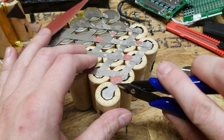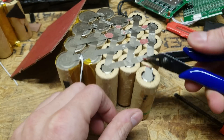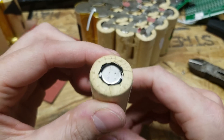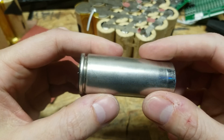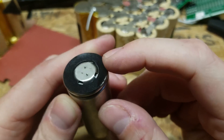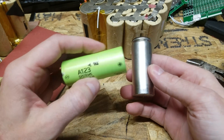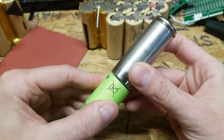Let's see if that works — just very carefully peel it off. These individual cells are unfortunately glued together. So there we go. There are no markings on the actual cell itself. If we slide the cell out of the sleeve, I see LHK HQ, but no brand or model markings at all. There's quite a decent insulator here on the top, and it's not paper like you usually see — it appears to be some kind of hard plastic, which is nice. This does appear to be a 26650 cell. I have here an A123 battery, which is a 26650, and they are the same exact dimensions — the same height and the same diameter as well.